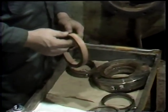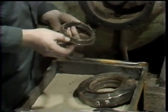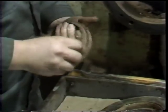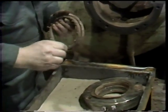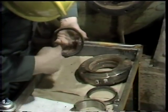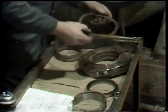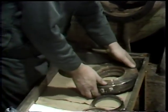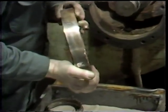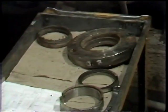After setting the seal face aside, he then examines the restricting bushing which was placed in the stuffing box. This part is replaceable and therefore will be replaced with a new one upon reassembly. He then begins an examination of the stationary portions of the seal — the stationary seal face and the springs around that face which are used to maintain tension on the seal. He examines the face of the seal itself and again finds no unusual wear; while there is some wear evident, the seal face can obviously be reused. The gasket from the seal plate is discarded and will be replaced with a new one. The seal plate itself is a part which rarely wears, and after examining the sealing surfaces he sets it aside.